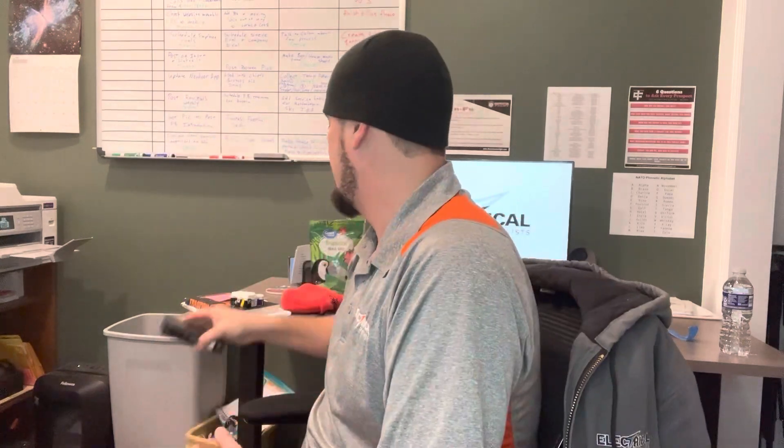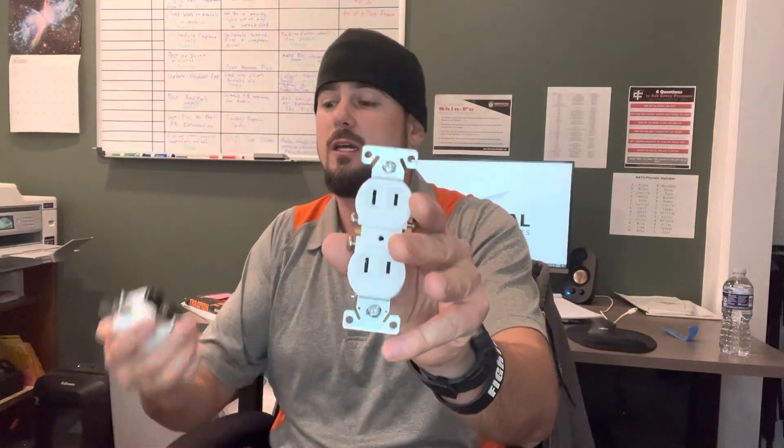So this is a much more efficient way to go from two- to three-prong instead of rewiring your entire house. I wouldn't stop anybody from rewiring, but it is very costly — nobody likes to do it. It means tons of attic crawling, crawling through the crawl space, trying not to drill a million holes in the wall. It's just cheaper to rip the sheetrock down to rewire than to try to do it with everything in place. This is one brand but they make them in many different brands. As long as your panel is new enough to accept an arc fault or dual function breaker, this is the solution. If you're tired of your two-prong plugs and want to go to three and don't want 65 devices around your house, we'd be happy to install these in your panel and make everything arc fault and ground fault protected.